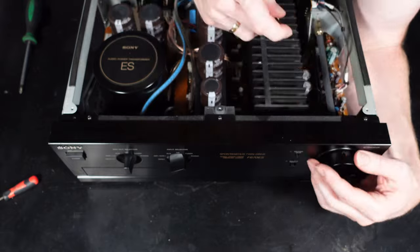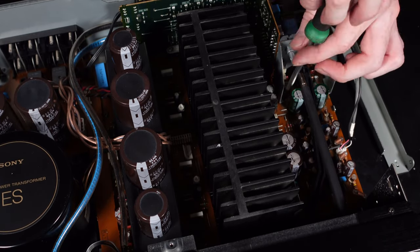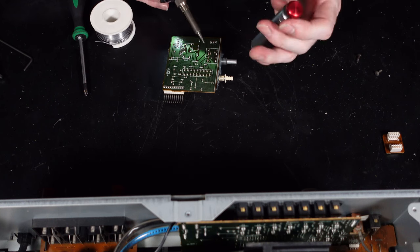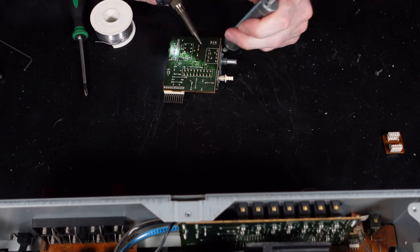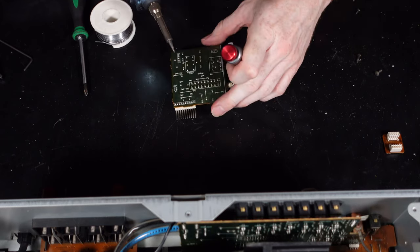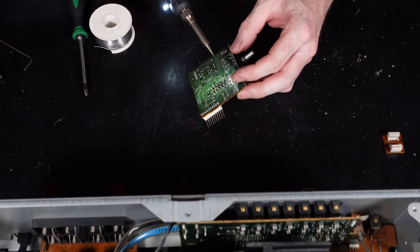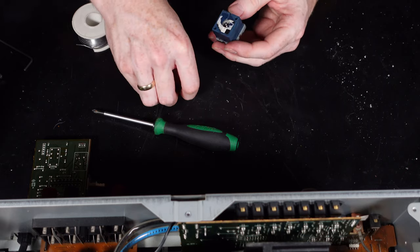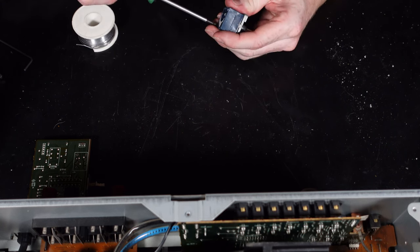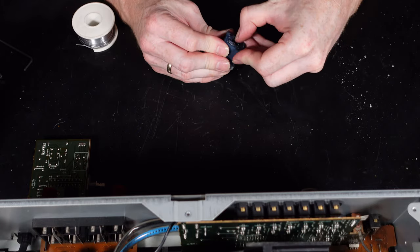Next job is to sort out the volume control crackling and occasional dipping out of the sound. I'm almost positive that this is just a case of cleaning the volume potentiometer. I did this initially the hard way, then realized the side frame could be removed which made it a lot easier to get the volume control board out of the unit. It's two screws that hold the small side frame and two screws that hold the frame connected to the volume control board. Now that it's outside of the unit I can unsolder the volume control potentiometer. This is a 60k ohm Alps type component. I did look to see if I could replace this if required but couldn't find the exact same one — I found a 50k type but not the 60k. The only problem with these potentiometers is that they are pretty much sealed. You can take the two screws off to remove the lid but can only get in so far. There are two separate contact surfaces for left and right channels. What I actually did was remove the screws and take the cover off, then spray that area with deoxit working the controls. Then to get to the other contact area I managed to open the case just enough to spray the deoxit in on the other side, hoping this would be enough to sort it out.